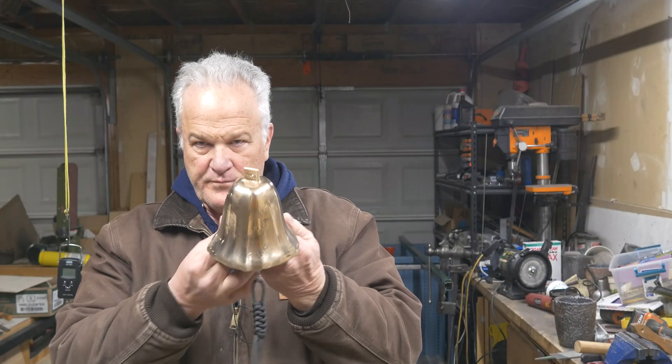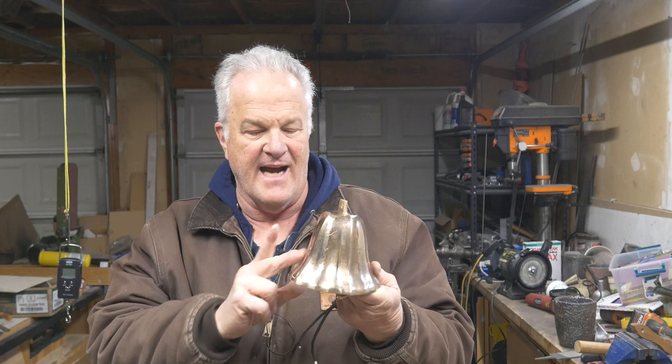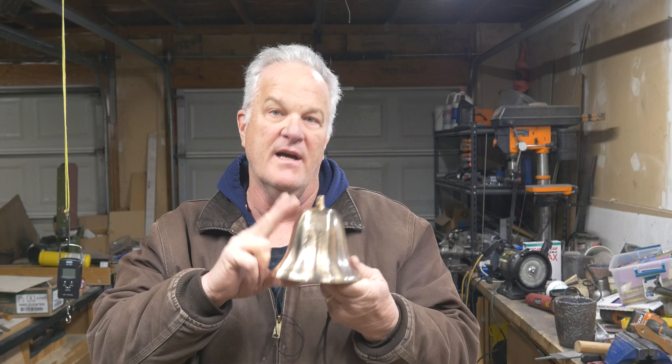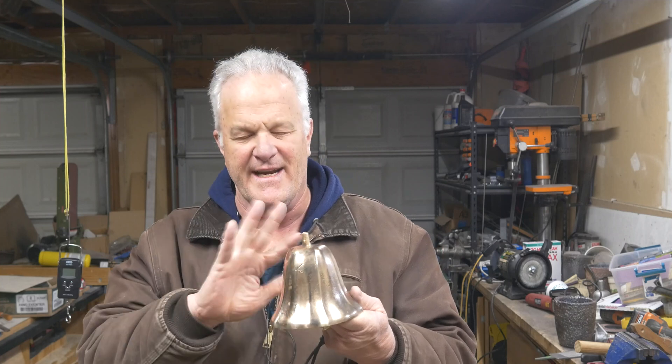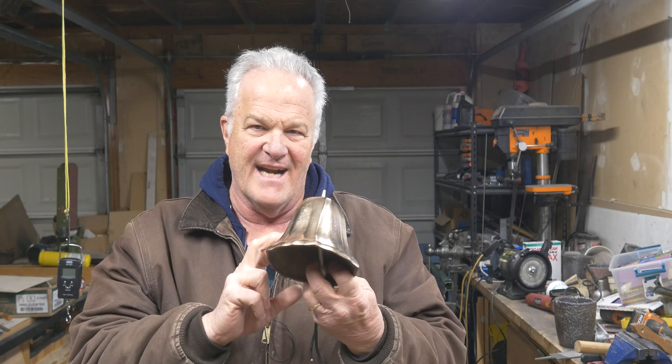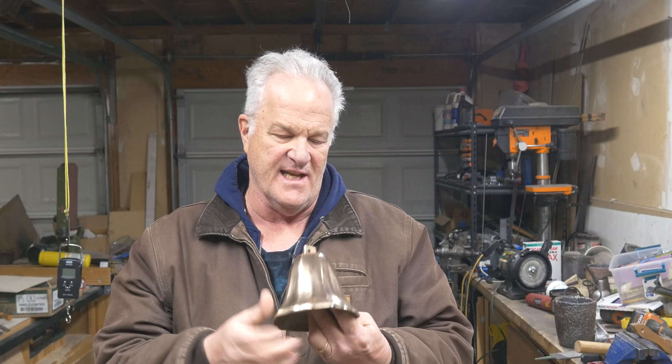Here's the first bell. What I did wrong with this bell is I made the wrong alloy. This is a copper-tin alloy — 90% copper, 10% tin. Bell metal is normally 20% tin: it's 80-20, not 90-10. So not enough tin in this thing. I looked at this bell and thought there's something wrong with it, and I realized it was the color — it was too red, too much of a copper color. After thinking about it I realized I made the wrong ratio. So I decided to go ahead and cast the same thing over again with the proper ratio.